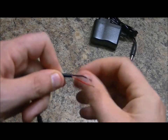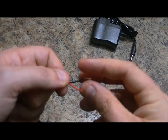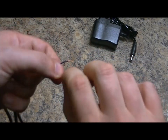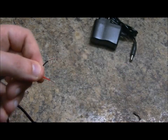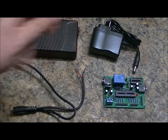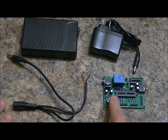So I've cut away one of the jacks, and now I've exposed the wires. I've got a red one and I've got a black one. What I'm going to do is twist them up so it's nice and strong. It's one cable, it's not a bunch of strands, and then I'm going to use a little bit of solder, and I'm going to tip the ends. I should mention that the link to this battery pack is below. Again, I can't attest to the quality, but the link is below. So I've tipped the red and black wire. I'm going to show you this attached to a Betty in just a minute, but just to give you a close-up, I'm going to connect it here.